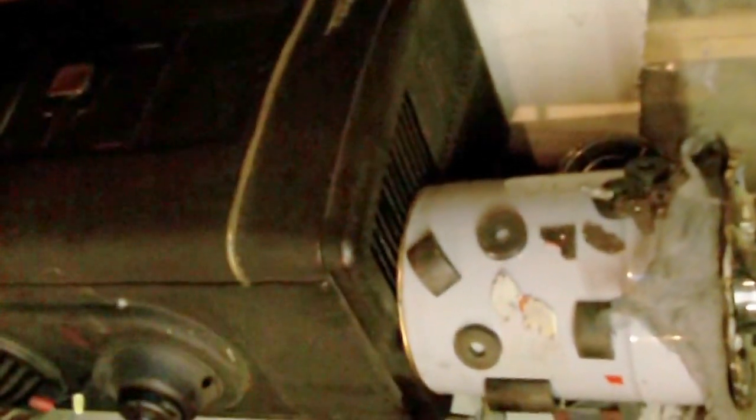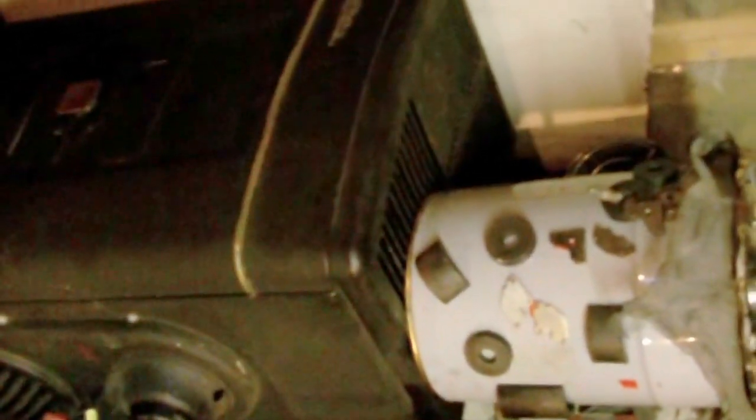To start the furnace you have to pour in a little diesel fuel. What I do is pour some diesel into this funnel — about a funnel full — and then start the oil dripping. Then you just roll up some newspaper, throw it into the bottom of the burner, light it, and away you go. It'll start heating up gradually and then throw off lots of heat.